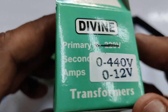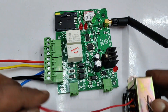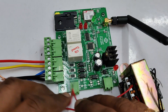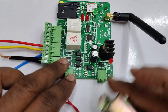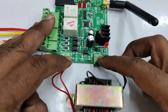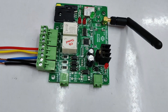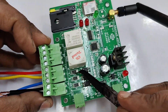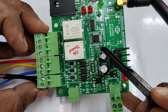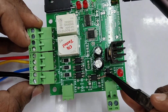The R and B connection are provided to a separate connector so you get 440 volt at this connector. You can connect a transformer like this — 0-440 primary and 0-12 volt 1 ampere secondary. The primary goes to the 440 volt RB connector. The secondary of the transformer gives 0-12 volt and is connected to the power source. You can also connect a direct power adapter at the 12 volt source. At the RYB points there are high value 474 resistances, and for safety, PC817 optocouplers are used.